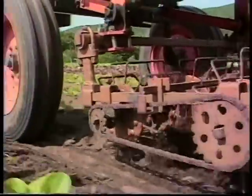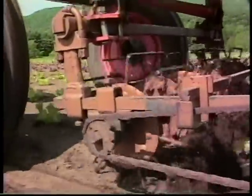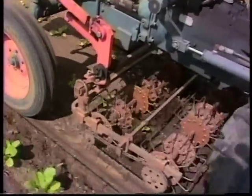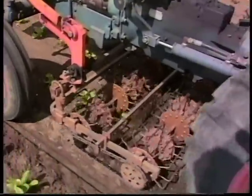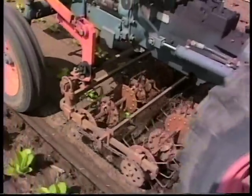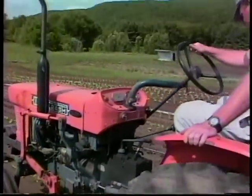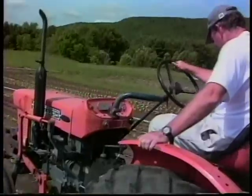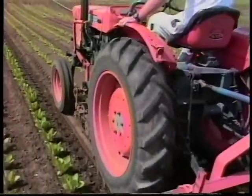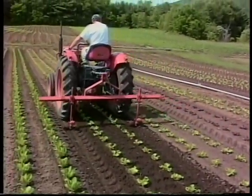Wait about a week because we get a little bit of germination, but we don't want to wait too long because we don't want the weeds to be too big. The advantage of the belly mount is that it does not wander. The cultivating tool doesn't wander in the field as it would behind the tractor. I'm able to view straight down at a single row. I can't see both rows, but I can see one row, and I can see exactly where I'm placing the tool. Absolutely exactly. If I daydream a little bit and it wanders off, I can catch it real quick,